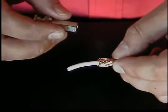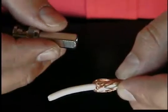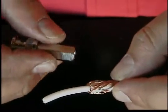You'll notice we have a copper shield. This is very important — leave it on, don't cut this off. One of the reasons you want this to make contact is the connector itself will make a ground to the shield, and this will avoid the shadowing effect on your monitor for your security cameras.